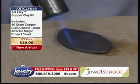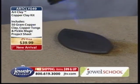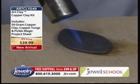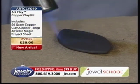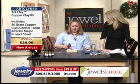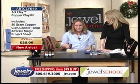The problem with the copper is that there's a multi-stage color of a glow. I cannot tell if this is the deep enough red we need, or if this is the just under temperature pinkish glow. Folks, when you're at home doing this, you need to do this in the dark. In the absolute dark, because the color, I'm talking deep cherry. And how long does it normally take to get it there? Because we're using the same micro torch we use for silver, it can take a little bit of time.